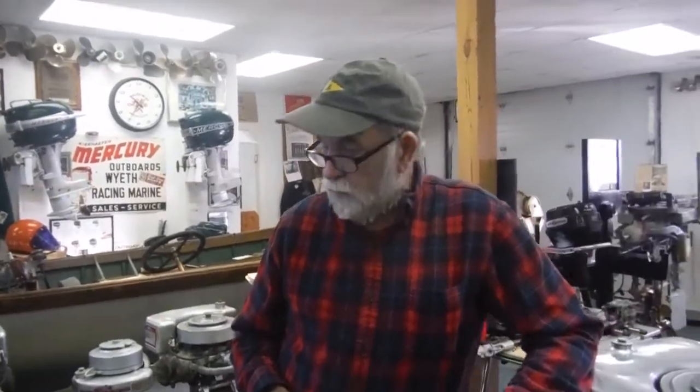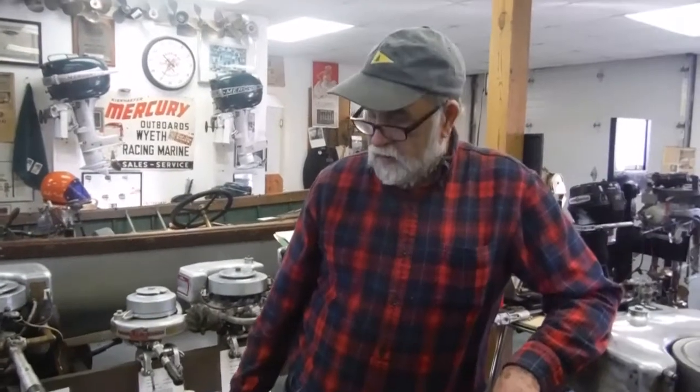Right. So I've had Johnsons that I've had to dig the tar out of where the coil mounts in the stator plate. They fill that whole recess with tar. Yes. And I've had Johnsons not spark and then testing the coil, they test good. Well, they track after a while. You get water in there and dirt and grit and carbon stuff, and it tracks. So the tar's gotta go, and I don't use the tars. In this modern era, with all kinds of great other materials, that black tar is like the last thing you want.